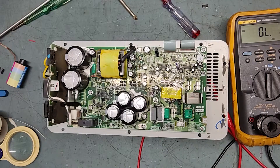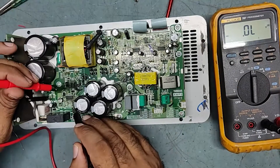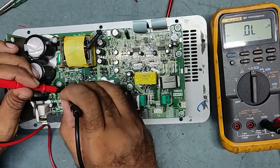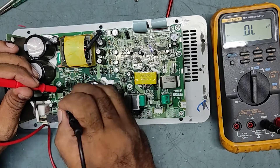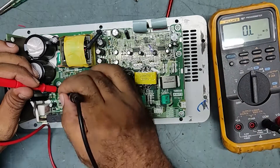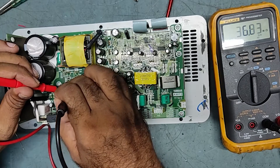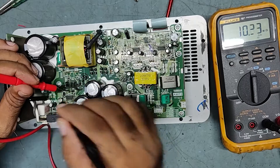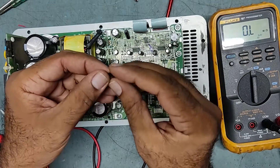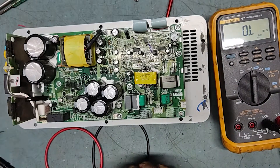Just to confirm — before, pin number 12 was showing 70 ohms. Now with the multimeter in diode range, pin number 12 is showing in megaohms. So before this pin was showing 70 ohms meaning the IC was shorted. We have replaced this high voltage resonant controller IC L6599D with a new one. Now we'll put it on and check the status.